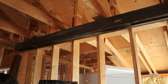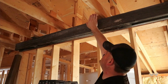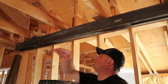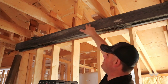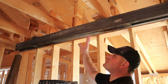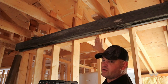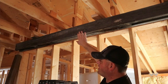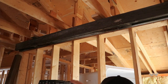I'm on my own right now, but it is possible to do it. This actually spans more trusses than I really need, but what I did is I used some scrap 2x4 material and screwed it together to create an L — screwed the vertical to the truss, and then screwed the horizontal down into the top of this beam. That's just going to hold the beam in place while I put the 4x4 verticals underneath it to support the weight of these three trusses while I cut this section of wall out so I can do my reframing.